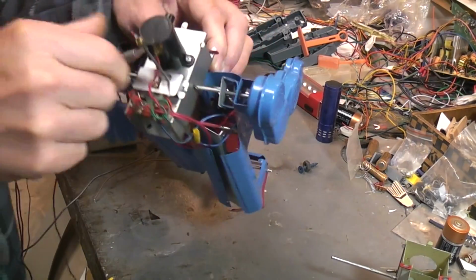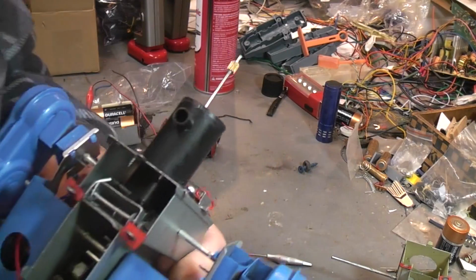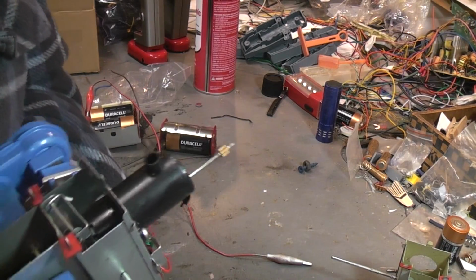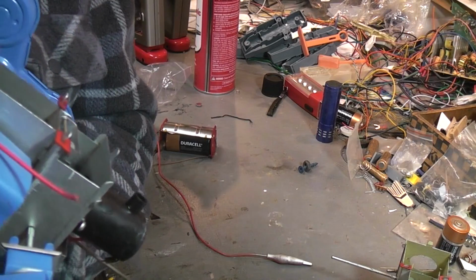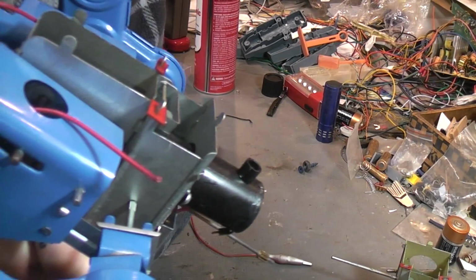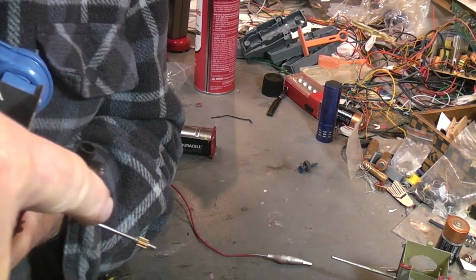So, smoker's still good in that one. At least with these China type smoking robots, when they quit smoking because the oil reservoir is so small, you can not just lay them on the back, but tip them a little bit more head down, and then if you put your drops of light grade oil or smoke fluid, glycol, whichever you prefer to use, you kind of want it to be able to run back up into the top.